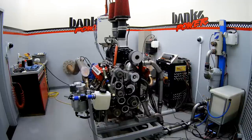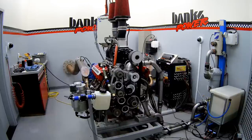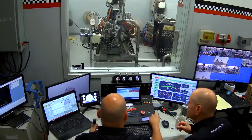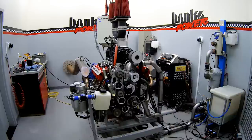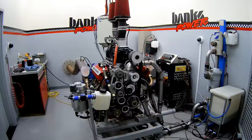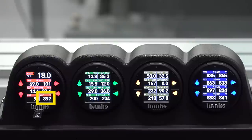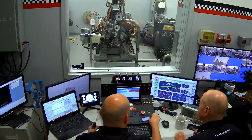We've made all the other pulls. This is 5,000 RPM — let's go for it. I'm keeping an eye on the compressor discharge temperature and the boost. Here it comes — 4,000 RPM, 330 degrees, 350 degrees. 5,000 RPM, 18 pounds of boost. We're coming up — I don't like this. We're almost to 400 degrees. Let's get the hell out of here.